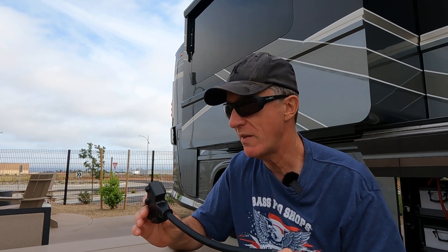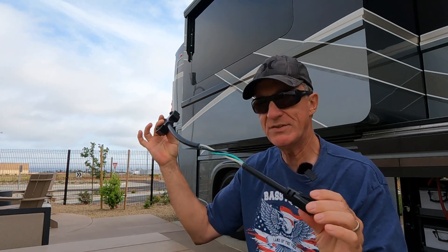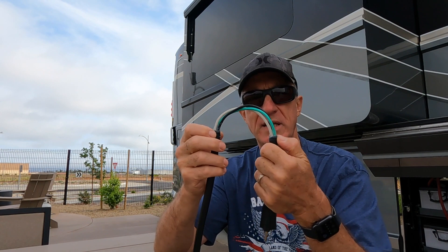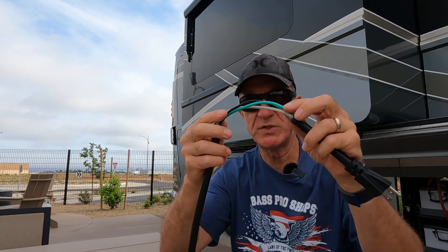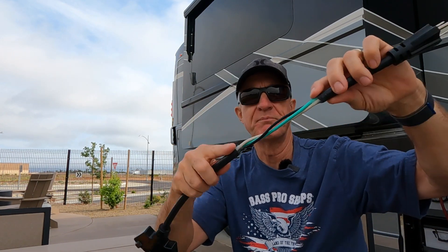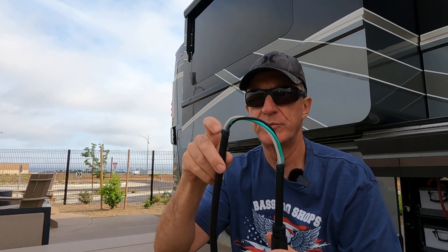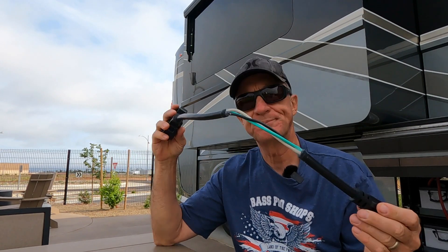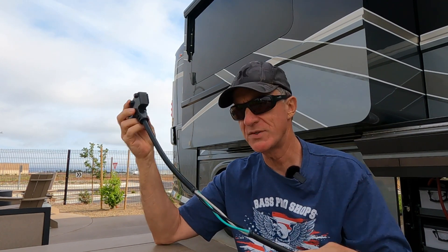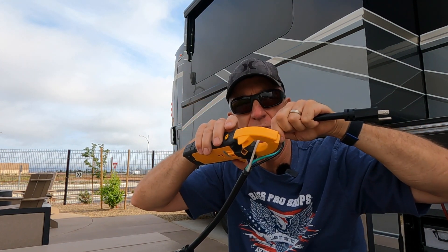I'm going to give you some examples and show you how this works. So I went to Home Depot and I bought myself a pigtail — an 18-inch pigtail. What I did was I carefully — and I can't emphasize enough, carefully — scored and stripped away the insulative housing, exposing the three conductors. I cleaned it all up, sliced it down, and pulled that off in about a six-inch section. Then I sealed it up with silicone on each end just to kind of seal things off and make it neater — totally not necessary. What does this do? Well, it allows you to put this little hack in between your power source and your appliance. And guess what you can do now? You can go right around that hot lead, face it in the right direction, and now you can measure AC current.